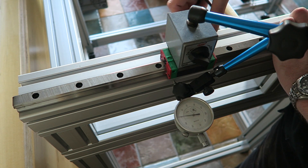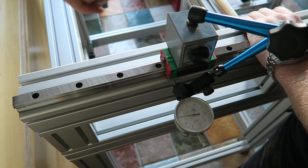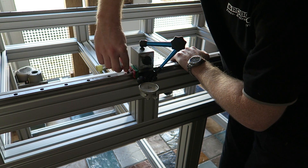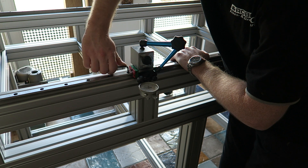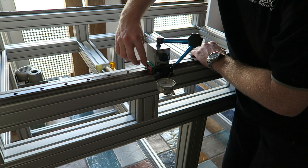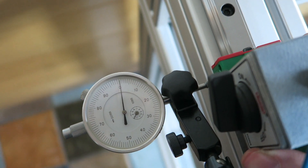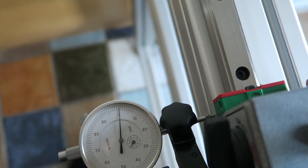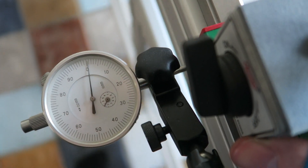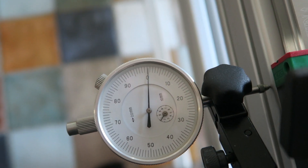When you do this and check it a few times you can really get it to a really close fit, close tolerance to the side of the machine. I'm assuming that the side of the machine rail is quite square — but talking to the people at Daamen CNC and Hiwin I can assume it is. As you can see I got it within one hundredth of a millimeter, which is even smaller than half a thou if you're talking in inches.